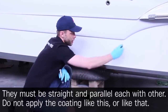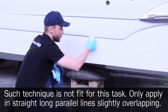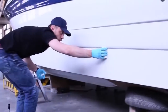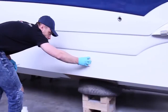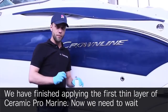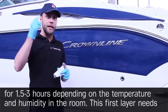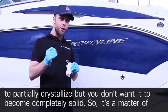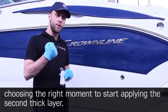Do not apply the coating in random directions — only straight, long parallel lines, slightly overlapping. Once the first thin layer is complete, wait one and a half to three hours depending on temperature and humidity. This first layer needs to partially crystallize, but you don't want it to become completely solid, so it's a matter of choosing the right moment to start applying the second thick layer.